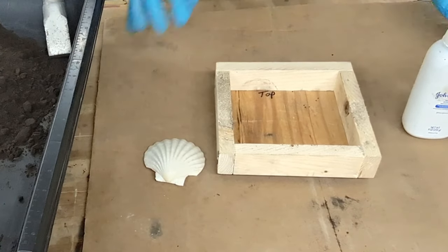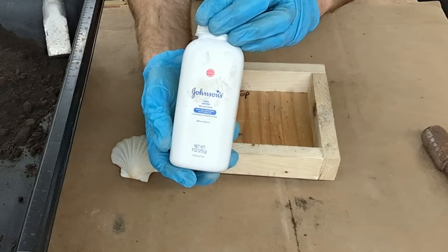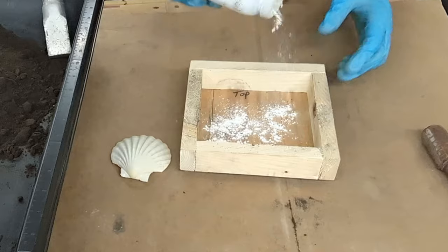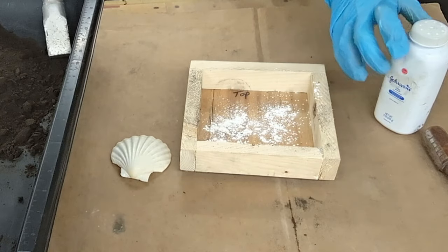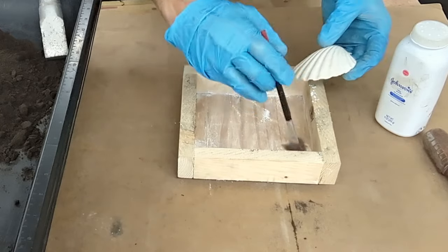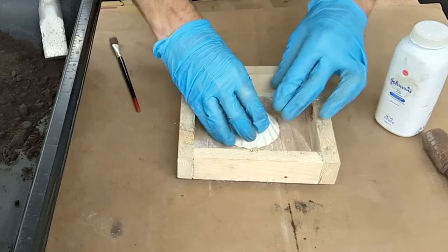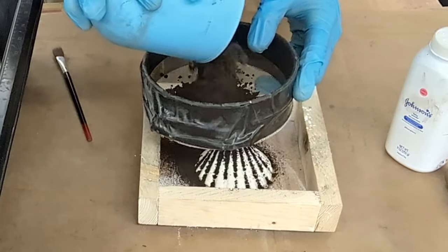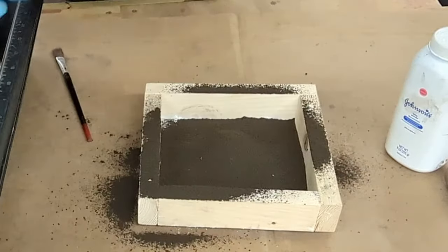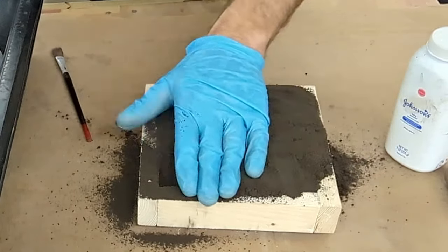What I'm trying to achieve is to make a cavity in the sand in the form of this seashell. I'll place the shell facing down and add talcum powder to this half of the box. This is so the shell and the other half of the box does not stick to each other. I'll start by sifting the sand over top to try to capture more detail.